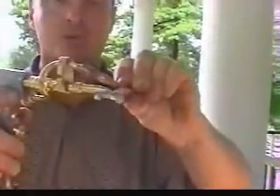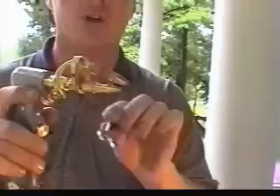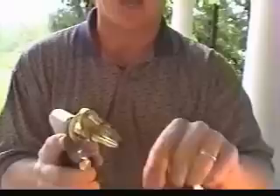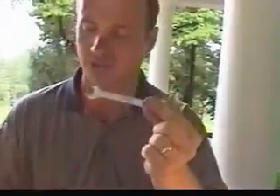We're cutting as nice as a plasma cutter, and our tips last much longer than a plasma cutter. One thing I need to mention about the cutting attachment: the wrench serves as a feeler gauge. You always want to make sure the clearance between those two tips is the same thickness as that wrench. That goes for the undercutter for sheet metal or the overcutter. Just remember, keep your tips in line with each other, and the distance between the tips should equal the thickness of that wrench — the wrench that comes in the kit.